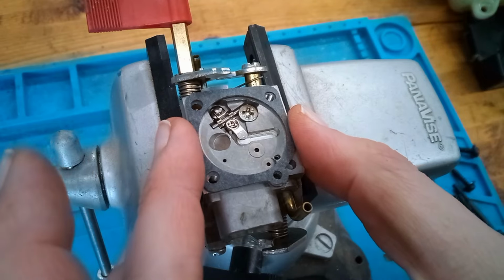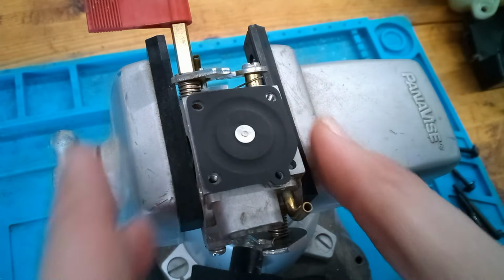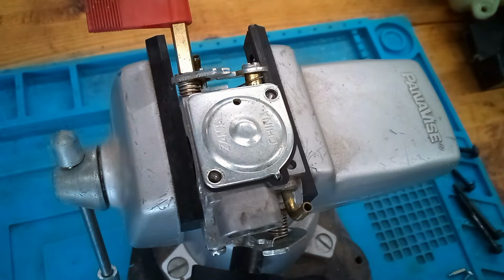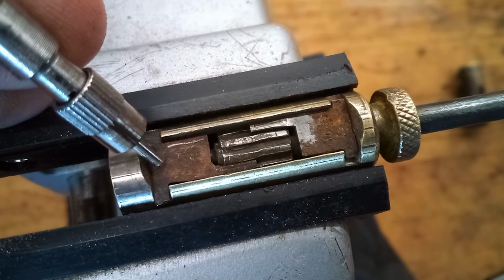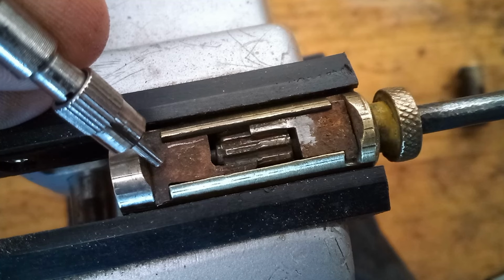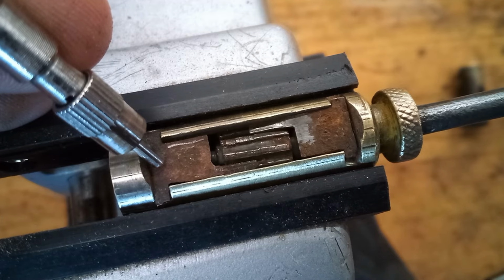They're great for holding 2-cycle carburetors while rebuilding them. Since the plastic jaws are non-marring, they won't damage the gasket surfaces on the carb, and you don't have to worry about crushing it like you could in a larger vise. This clip here is from that video where we made a new pawl for a ratcheting screwdriver. You'd crush this little thing squeezing it in a regular vise, but the PanaVise is the perfect size to hold it, while not squeezing it too tightly.